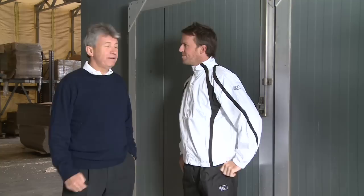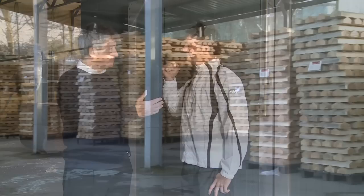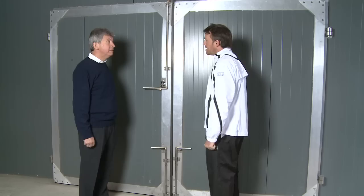I think you'd get a lot of runs with that one. So when we decide we need to put some bats through the manufacturing process, they come out of the yard into the dehumidifier. It takes about 17 or 18 days to get down to the right moisture content. They're nice and cold in the yard, they come here and warm up, ready to be made into a new bat. The moisture content is vital to making a good bat, so it's firstly resilient but as light as possible as well.